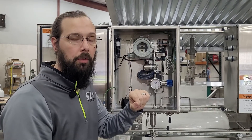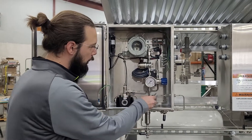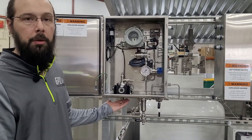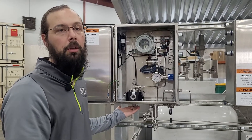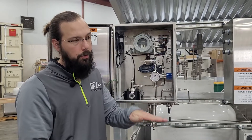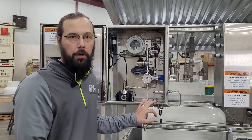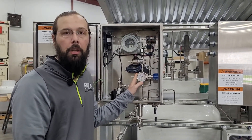The reason I mentioned the dome-fed pressure sensing on this regulator is because of this line right here that preloads your regulator. This will sense pipeline gas as the outlet of the drip chamber on the bottom gets connected to the pipeline and senses the gas pressure in the pipeline. This means that as the odorizer is operating, if you have fluctuations in the pressure inside of your pipeline — which is typical — the odorizer will not have to be reset for those pressure fluctuations. All we need here is the differential, as is standard with the GPL 750.